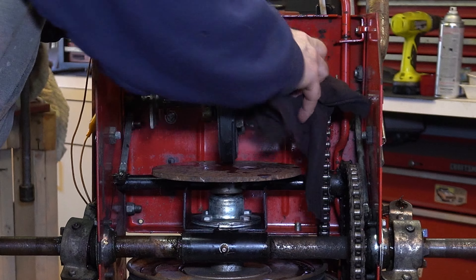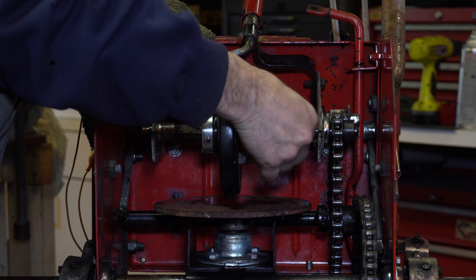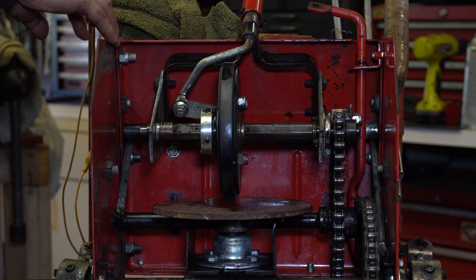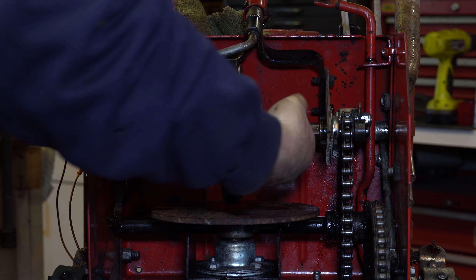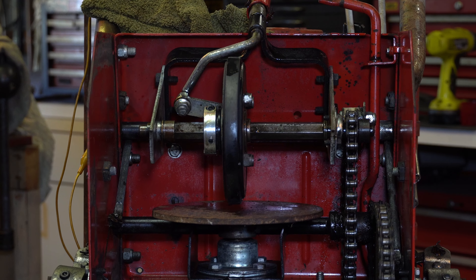It's not moving fully the way I want it. So this is first gear—neutral. Okay, so this is neutral right here where we are now, and it should be over more. It's moving well, I just keep putting a little bit of oil on, penetrant, and checking to make sure. It feels like there's a little bit of pitting on here. We'll get to that if I have to hit it again. Just keep putting oil on until the oil comes clean. If you're getting black and gook, it's not as dirty as it was. This is neutral; it should be back further. That's first—you can see we're running out of room. That's second and we're already at the end—I can't get to third.